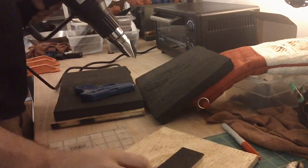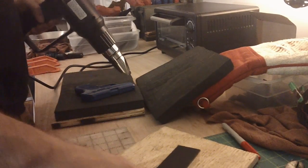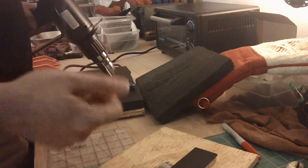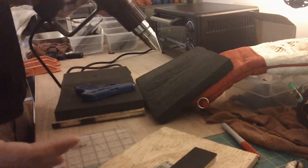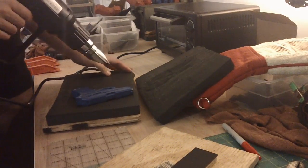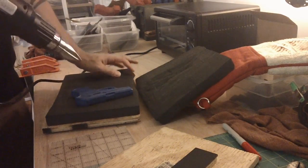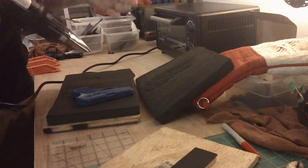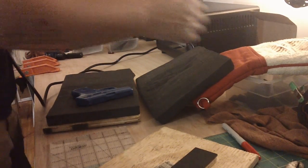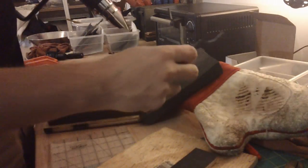But at any rate, if you put the pre-scored Kydex in the press with your belt loop die, to a degree, as you heat it up, it will self-heal really substantially, in a remarkable way. The scores that you put into it, but once it's out of the press and it's all cooled down, you can find the little lines that you've scored, and you can just break them off like Kit Kat bars.